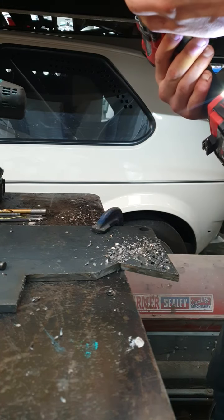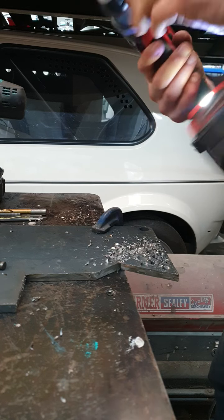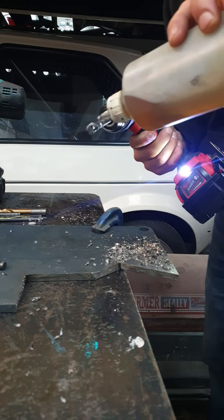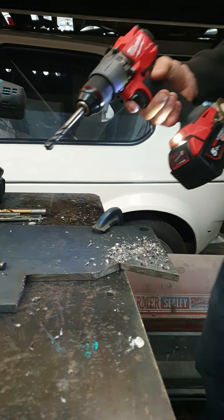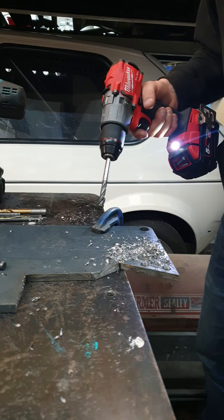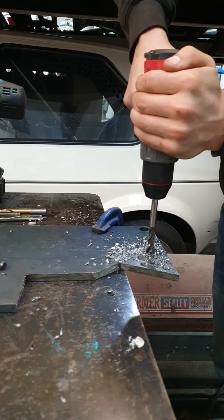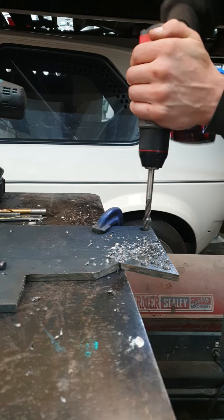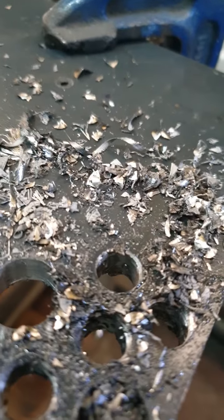This is an M12 spiral flute machine tap. A bit of oil. Even from previous tests I know I'm going to slow this one down. I'm not going to put the handle on because it's just a gimmick — the drill will give up before your wrist does. That's pretty poor. Not even got a full rotation there. We've got a hole but no threads.